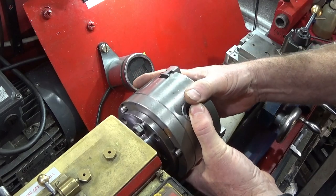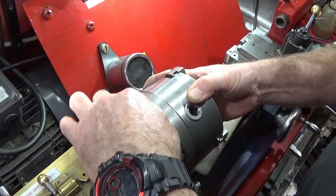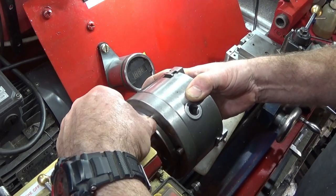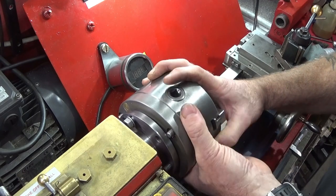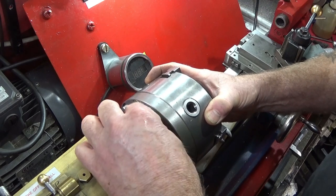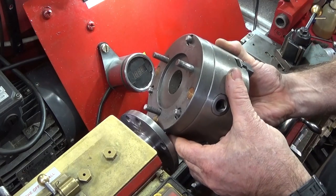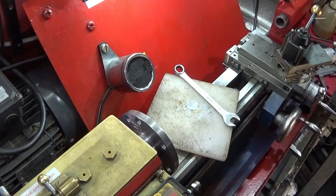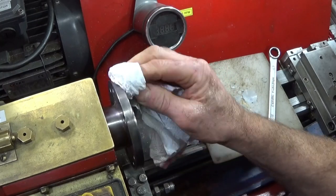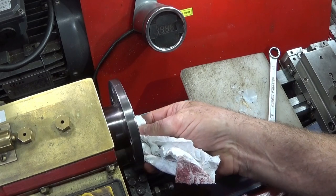You can just rest the thread on the inside of the bolt holes like that, and the last one. Then I thoroughly clean the spindle and the 100mm register which goes into the back of the ER collet chuck.